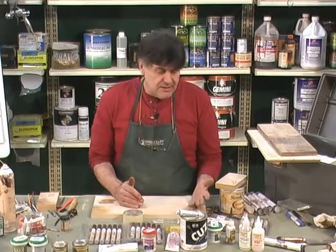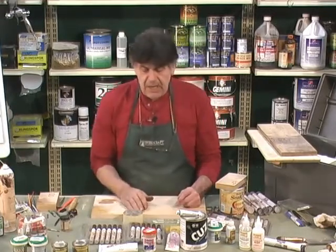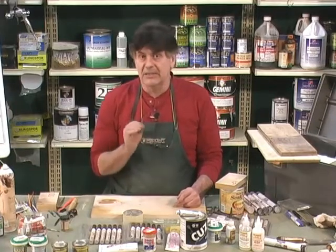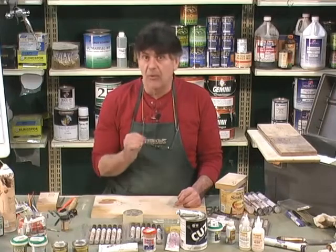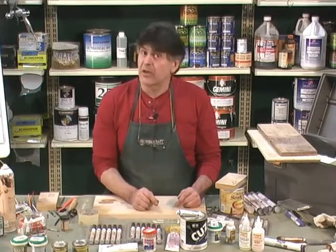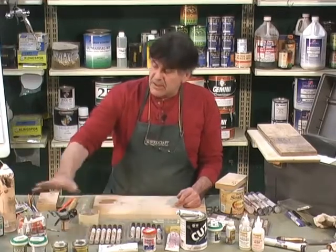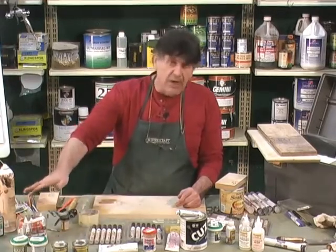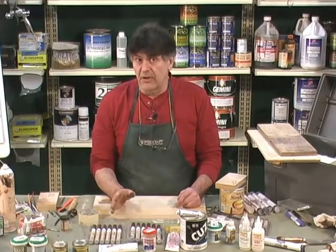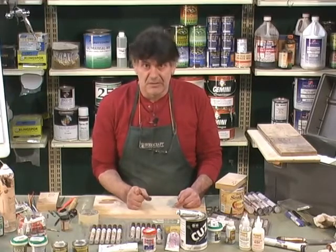Here's some of my findings. The epoxies, the cyanoacrylates, the polyesters, these are predominantly non-stainable, non-dyeable products. But they are tough. They are extremely tough. The water bases and the solvent base that you buy in putty form, they do a good job. They do a very good job. But they too have their limitations.